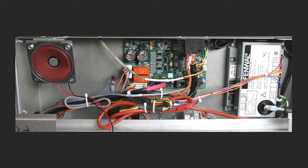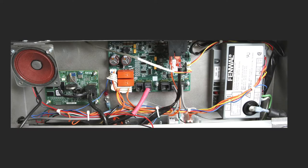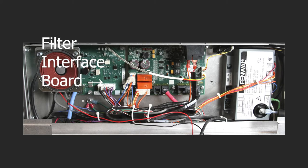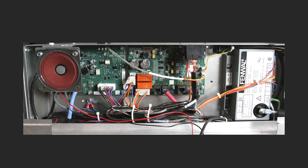There will be more about the time delay board later in this video. The middle control box includes a KCCM communication board and a small wireless modem that connects the fryer to the internet. The far left control box includes the filter interface board, which distributes 24 VDC to the valve interface board and related actuators, and the communication board.